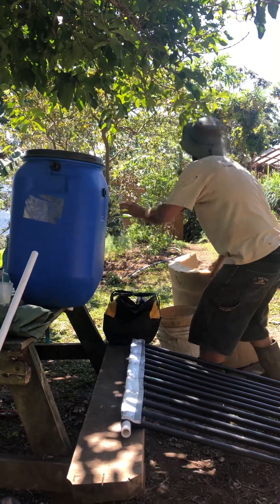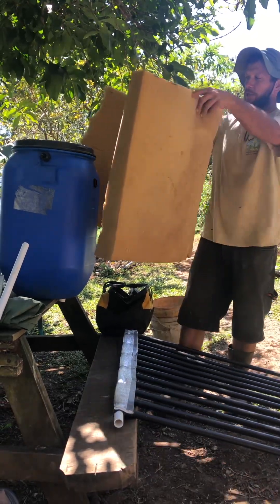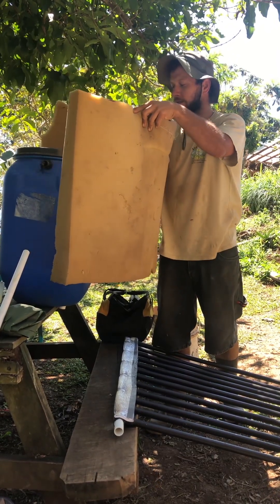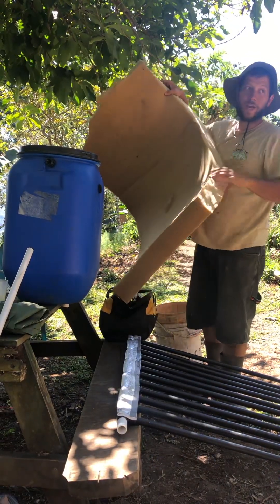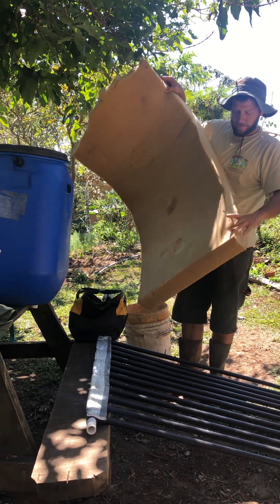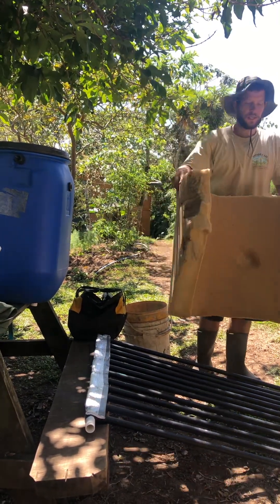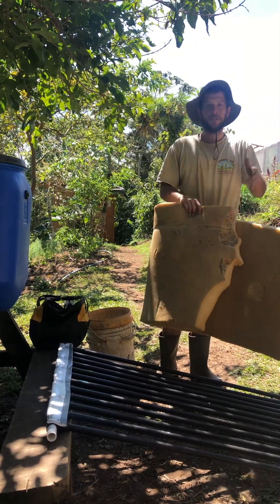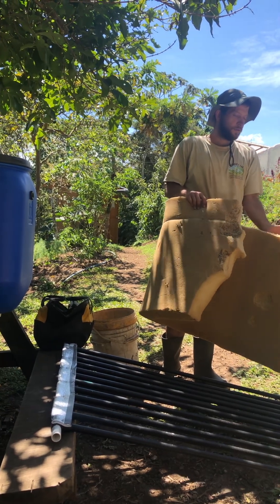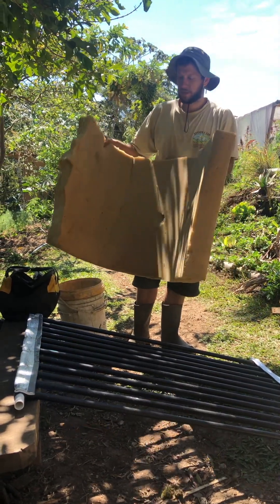Very important — you see that green circle on the roof? That's basically a bigger outer tank. What we do is insulate the inner tank so that hot water stays hot, because it gets cool enough at night to cool this down really fast. This insulation is just an old recycled piece of bedding. The only important thing about the insulation is it can't get wet. You need to have that outer tank really sealed from the rain, because water is a good conductor of heat — if the insulation is wet, the heat is going to escape.